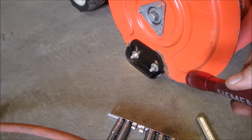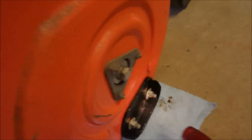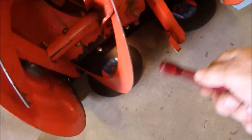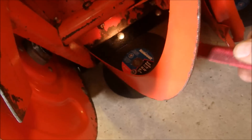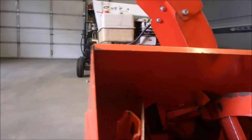Alright guys, now I'm setting the gap for the snowblower from the snowblower to the cement. On both sides the feet are touching the ground. What I did was I took two pieces — just an eighth of an inch — you can start at an eighth of an inch, you can see in there. I had enough blade to just tighten it up where I wanted. You set something underneath the snowblower, like an eighth of an inch gap, and then I came over to this side and put the feet on. So now we'll pull out the eighth of an inch guides.